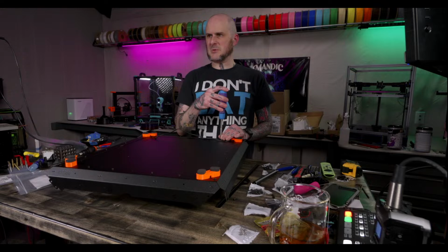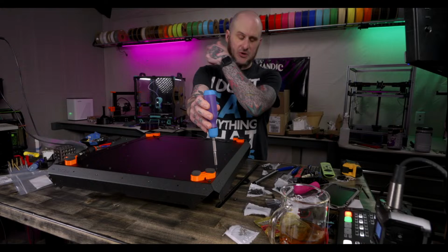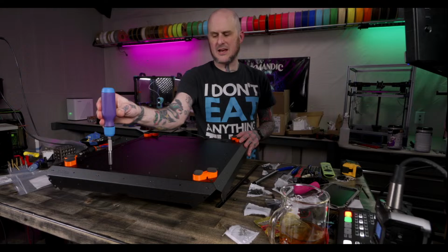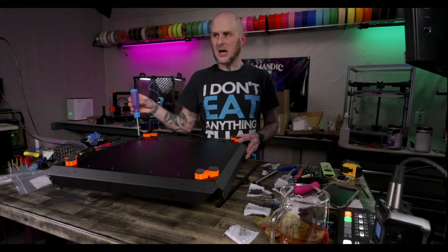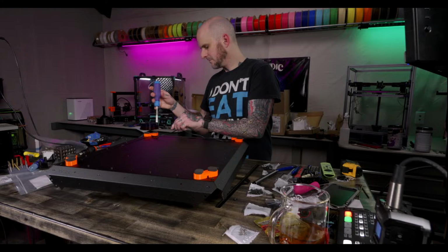Yeah, there is fan speed adjustment within Orca Slicer for overhangs or layer time. I don't run a ton of fan, but I'll run Polymaker ASA on a Stealth Burner on my 2.4. I'll run upwards of 60% part cooling on ASA. I want to cool my overhangs. I don't run into layer adhesion issues. I find Polymaker ASA is quite forgiving of cooling, and honestly wants it, in my experience. Not a ton, generally like 20-25% throughout the print, and then 15-75% depending on the extremeness of the overhang. That's what I find.